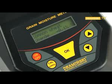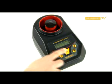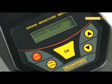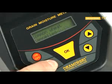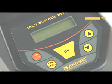Information confirming the change appears with a question mark. If you would like to save the changes, press OK. 'OK' will appear on the screen, meaning the changes are permanently stored, and a star appears in the bottom right-hand corner of the screen indicating a change of data for the grain name. However, if you do not want to save the changes, press the cancel button, which cancels the introduced changes. In order to leave the modify mode, the power supply should be switched off.